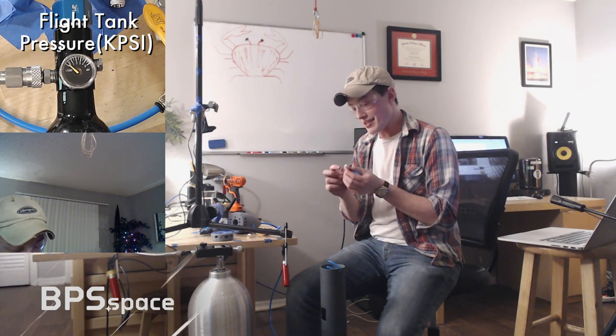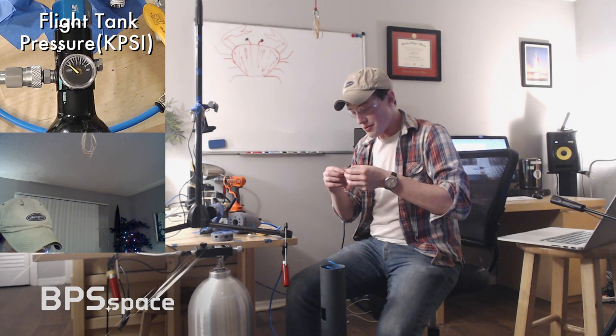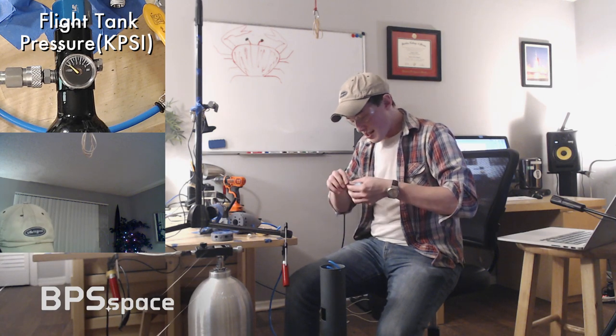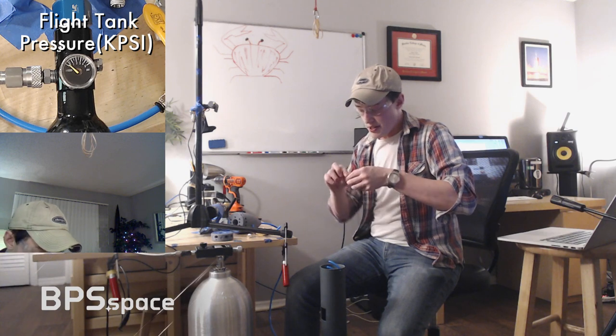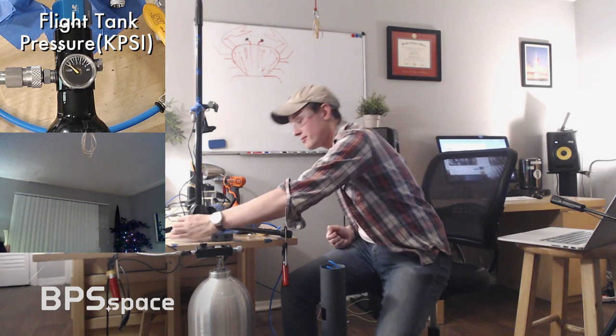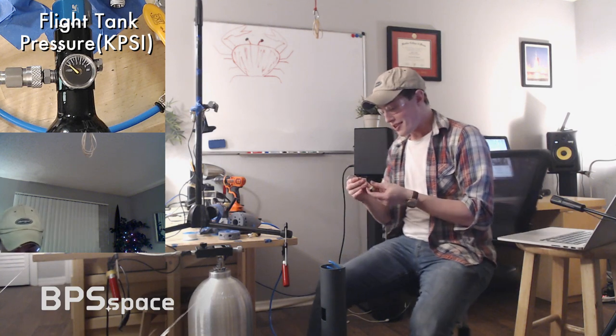Teflon tape these little tiny quarter inch plugs that are going to help us use these fittings. The Teflon tape helps prevent leaks too. So it's quite helpful. It's just also a little bit tedious, especially when you do a lot of valves at once. Okay, now it's going in here. When you plug up this hole, you said you wanted this. People said they wanted it, so.